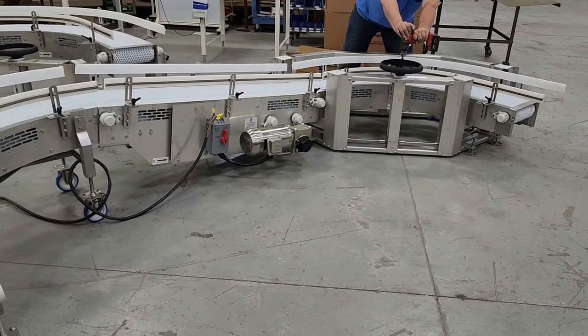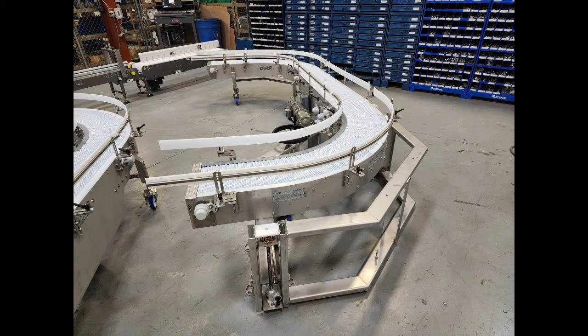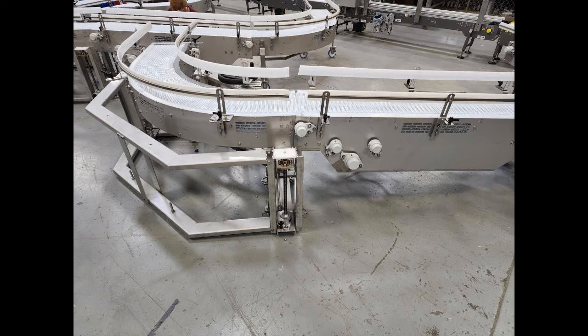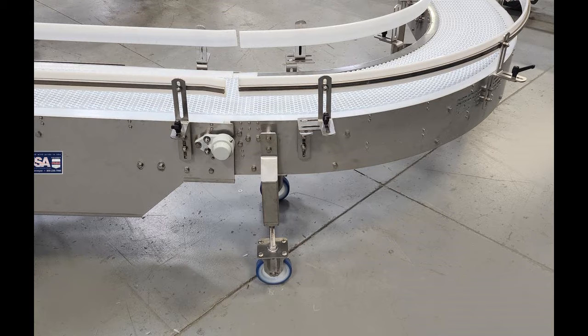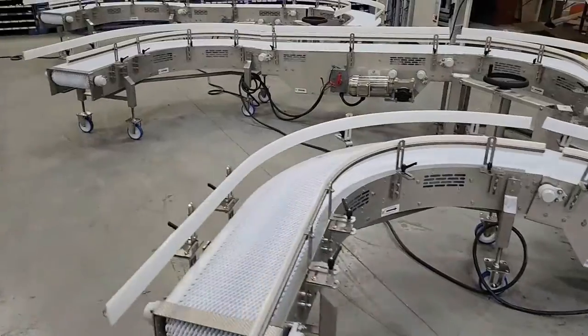The case erector discharge end uses stationary supports with adjustable articulating feet and a single bolt mounting tab for floor anchor. However, casters were used for pivoting vertical curve assemblies required at the in-feed, to allow for very slight incremental movements as the intermediate pivots up or down.